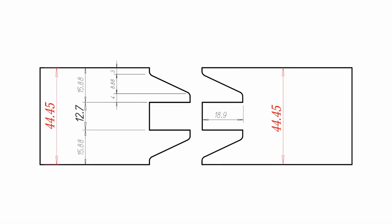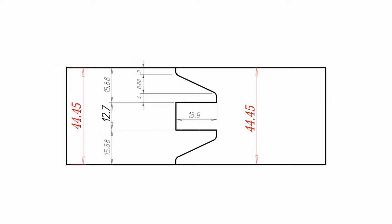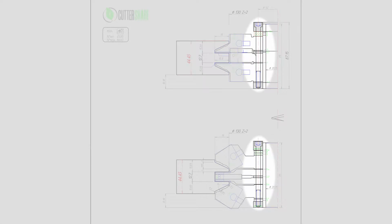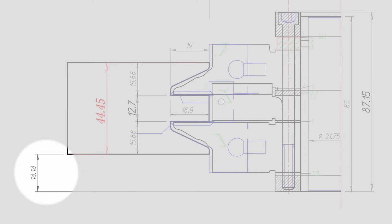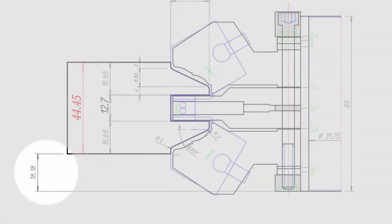The groove and tenon are a half inch wide by 3/4 inch deep. The joint closes up tight at the faces before the tenon bottoms out in the groove. These tool sets are fixed on a sleeve with no need for you to disassemble. To change from coping to profiling requires no vertical spindle movement, just change one assembly for the other.